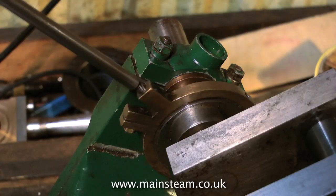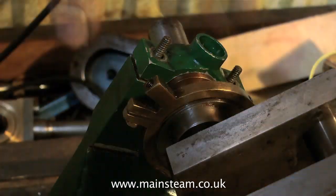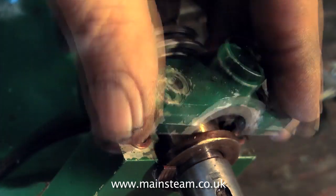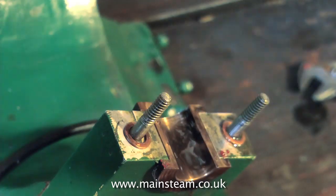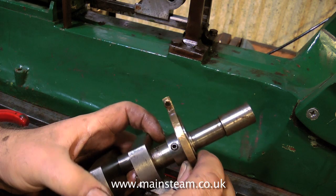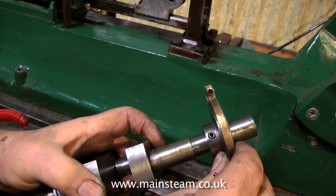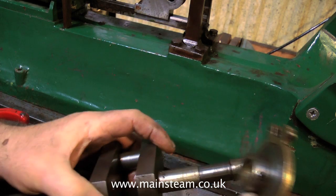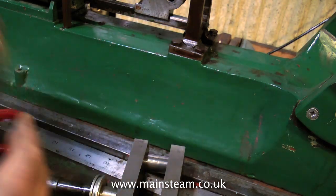Now it's time to remove the crankshaft. I'm going to have to do quite a lot with this crankshaft because it's very badly bent — bent at the flywheel end, so the flywheel wobbles about. If you want to have a look at the first video, I open it with the wobbly flywheel. The initial engineering standard on this engine was pretty good; as you can see, the eccentric sheave is coming off the crankshaft and it's a nice tight fit to it.